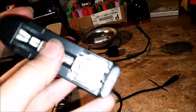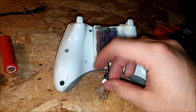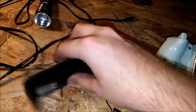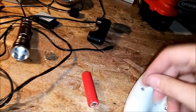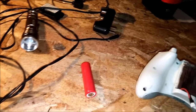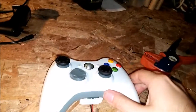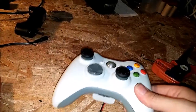You can modify it to where all you have to do is connect two wires and be able to charge it — put it in like a little plug. You can go to Radio Shack and get some little adapters that you can plug in. You can possibly turn one of these into a charger because they charge these 4.2 volt lithium ion batteries and these are practically the same thing. So you can do that if you want to go the cheap route. This battery pack works great.